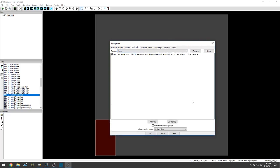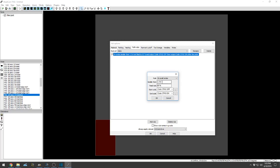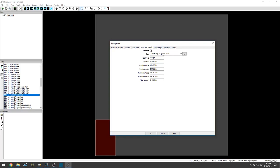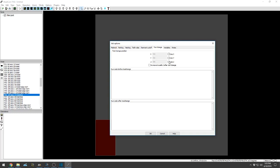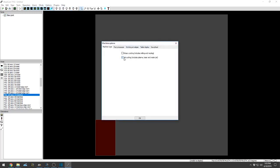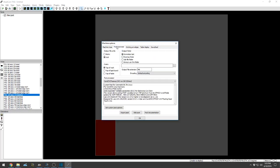In the output code, basically as the torch travels into a circle it cuts at 65% of the output. You can even change that by double-clicking and changing the circle size — 1.5 inches is fairly standard but you can change it to, say, two inches. Remnant cutoff I don't use a whole lot; I usually just do that by hand, but it's definitely a feature. Variables, nodes — all that's pretty straightforward. For Machine, you want it set up as Plasma, Laser, or Waterjet, unless you're going to be doing some milling or routing, but that'll be a different time.